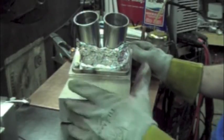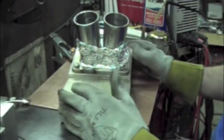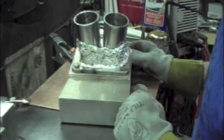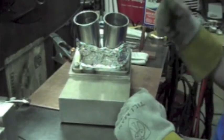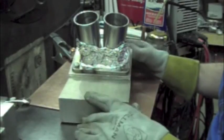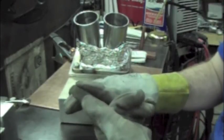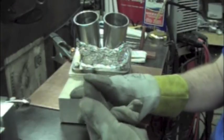And I'm also going to add a little bit of post-flow on there to help it stay shielded while it cools down, because I'm going to be camping out a little bit while I'm in there, and that'll be a good thing. Oh, and I have to turn the argon up, because the Monster nozzle likes to have a little bit more flow. So pre-flow, I'm going to crank it up to 1 second, add some post-flow, probably be like 13 seconds of post-flow, and I'm going to crank it up to probably 30 CFM on the argon flow.